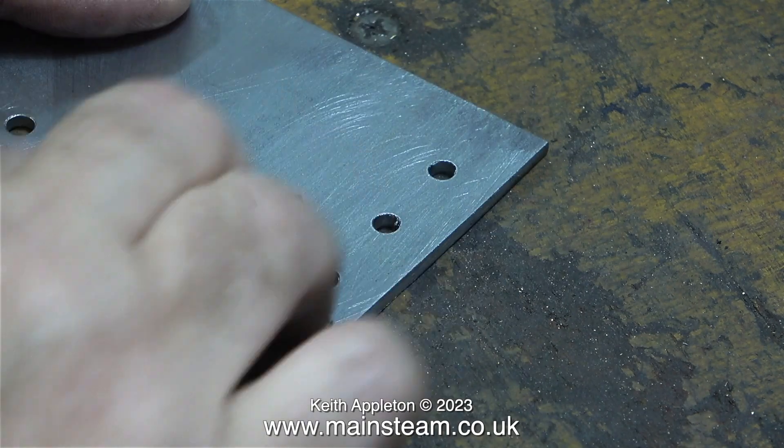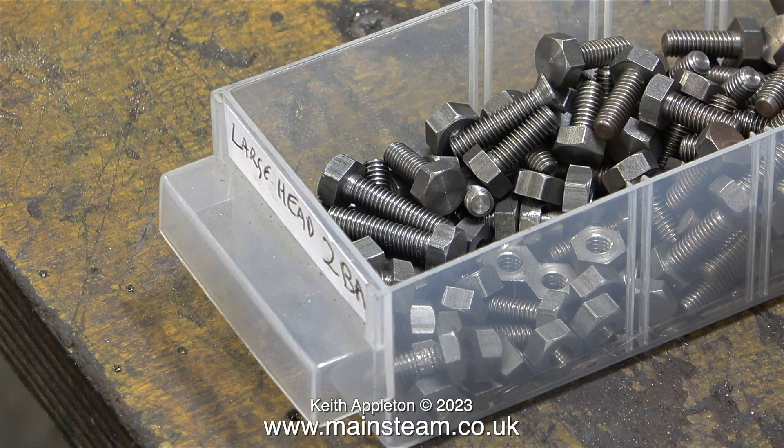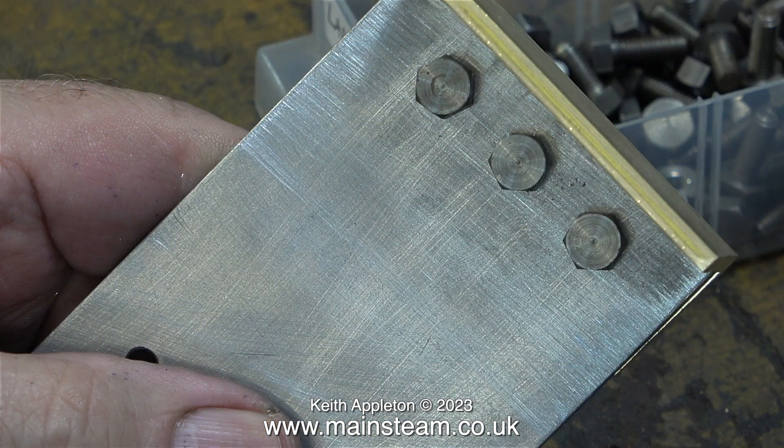Now they look like this and I'm cleaning up the area. The surfaces of all these parts need to be scratched — if you don't do that the surface of the steel will not be good for the paint and in no time at all the paint will flake off. Primer as well. Here's the box of 2BA large head bolts I'm going to use to hold the uprights to the bracket and the brass part to the uprights. In this clip I put the bolts in the wrong way around on purpose just to show the evenness of the hole spacing.